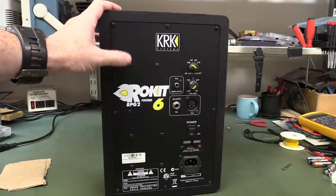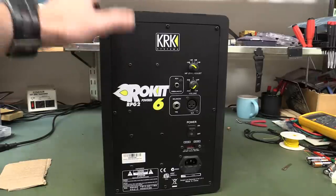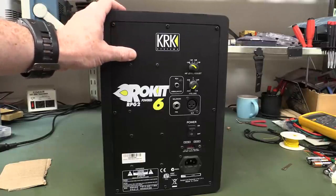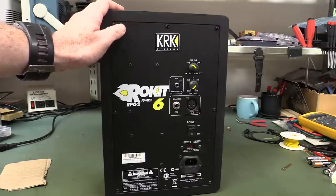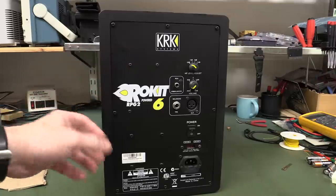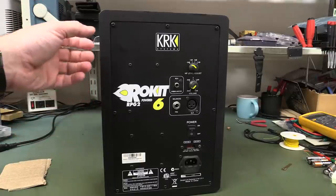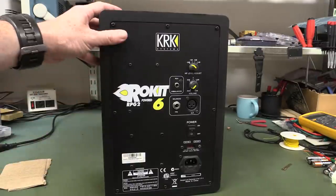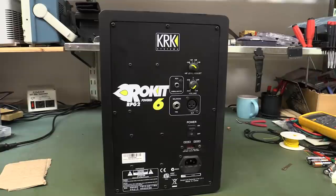I had a look online but didn't want to get any spoilers about whether this is a common fault. I was looking for the schematic but couldn't find it on first search. Even if the schematic's not available, it should still be relatively easy to troubleshoot, because it's probably going to use one of those off-the-shelf amplifier chips and you should be able to get the datasheet. The PCB might even be single-sided, which makes it easy to trace, since they do try and build these down to a price point.